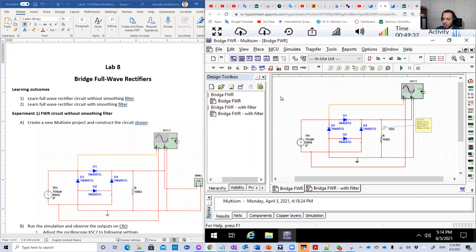So let's start with the default connection or the default setup for the bridge full-wave rectifier, in which we have the bridge. You can draw it using this way — you usually draw it like a diamond like this. But basically, it's a circuit and you can remove the wires and shape it the way you want. So you can basically draw it like a square in that connection like this. They are basically the same — we just squeezed it a little bit to make it like a square. So it was like the diamond in the lecture; we just squeezed it and it becomes a square. So that's basically a bridge. And here's the load that we will feed with the DC.